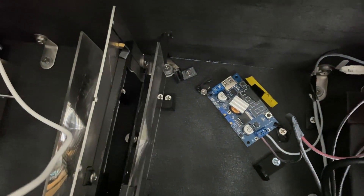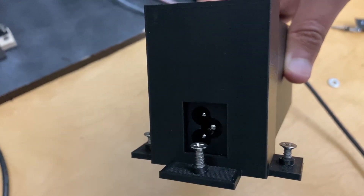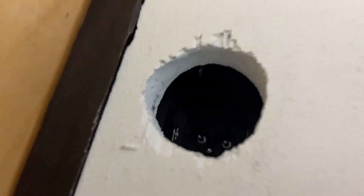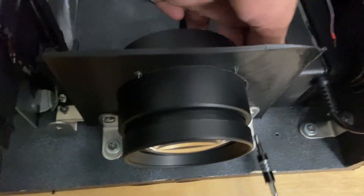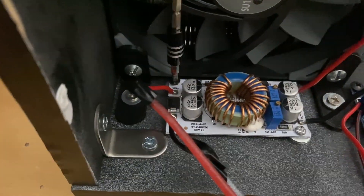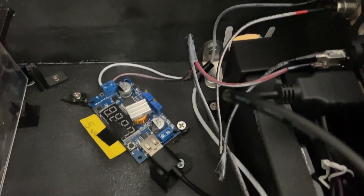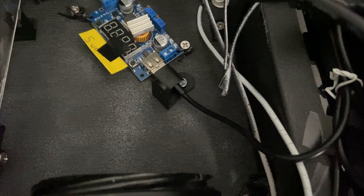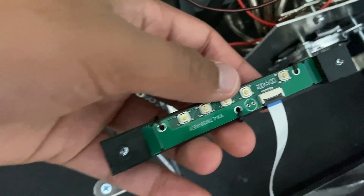Since I want to have an internal PSU, I unplugged the AC side of the power supply, and using a bracket, I managed to securely mount the brick inside the chassis. Using this hole, I can later plug in the power cable. I then mounted the brackets for the first surface mirror. After that, the projection lens was screwed to a plastic plate and screwed to the baseboard. We can now solder the wires from the switch and socket to the input of the LED boost converter and the buck converter for the fans. After fixing the booster in place, I coupled the keystone correction knob to the second Fresnel Lens and screwed the assembly in place. After connecting the input wires to the 5V buck, we can plug in the USB cable from the output of the buck to the LCD control board. The key is optional, but it adds a level of control over the projector.